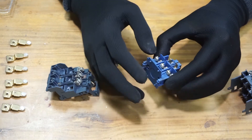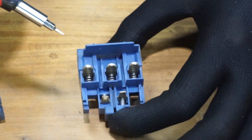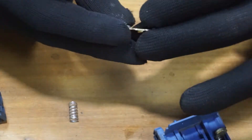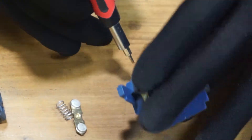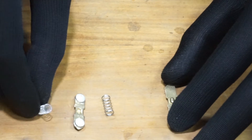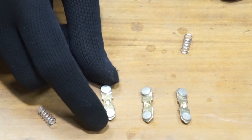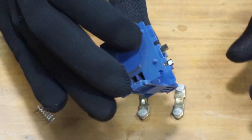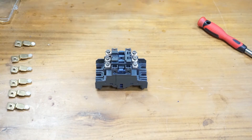These are the moving contacts. To remove them, you have to remove the springs that hold them in. In this case, the contact points are pretty good — I am not going to use sandpaper on these contact points. The auxiliary contact points are also good; I am not going to use sandpaper on them either. Let's insert the main contact points back into the housing.